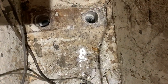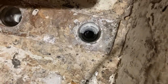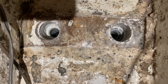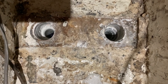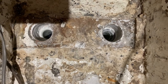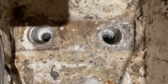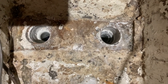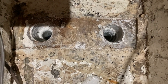So this is how the bolt holes look inside the boat. As you can see, they are fairly oversized. This is because the keel bolts were angled at different angles, and I couldn't reattach the keel. Otherwise, the only option I had was to make these holes larger. And when I reattached the keel, these oversized holes were filled by Sikaflex, which I dug out now.